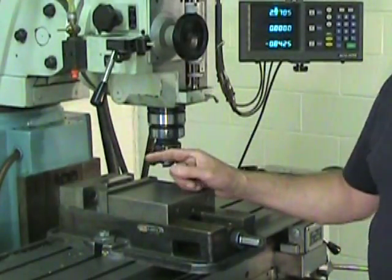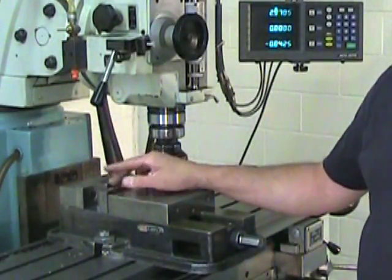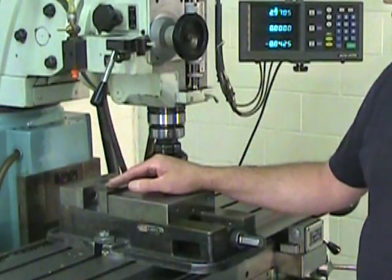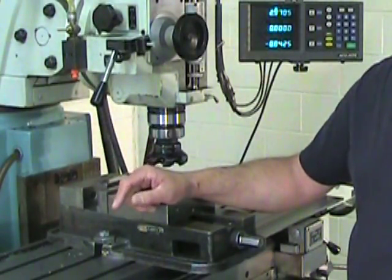And there you go. Our second secondary surface is complete. And it was pretty easy to do, because all it had to be was parallel to the first secondary, or the secondary reference surface. So, we have one primary, two secondaries, so we can move on to our tertiary surfaces.